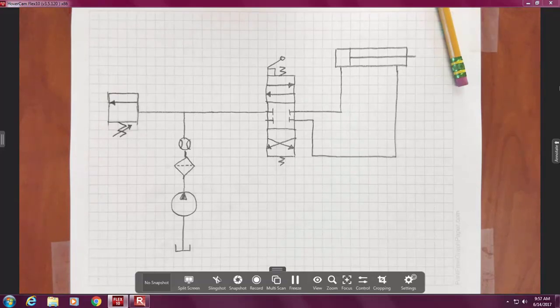Okay. There's a thing called a gearbox. It's a metal box. It has a hole for putting oil in, a hole for putting oil out, and it has another hole that has a little drill through it that's called the vent. In a gearbox is oil and air. Air condenses and contracts. Air expands. Gearbox runs hot, and somebody will say, well, they're all quarter-inch plugs. I'm just going to plug that vent. Then they get water, vapor, and other things, and the box destroys itself. Then they're like, well, didn't you notice the little plastic one had a little hole in it? Yeah, but I didn't think that mattered. You do that to a whole fleet of things, and then you keep having cascade problems. It's there for a reason.